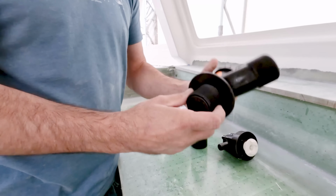And then that will flow down. Again, the base of the holding tank is angled, flowing back into where the drain is. And then the pickup deck fill is going to go directly above that as well. But I've got to get the top on first before I can get that in there. And the next step with that, once this glass cures on this PVC pipe, is to go through and clean up this area, barrier coat it, and get a tank coating on the inside so it's a smooth surface in there. And then I can put the actual top on and kind of go from there.